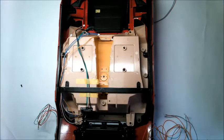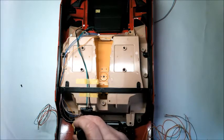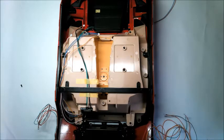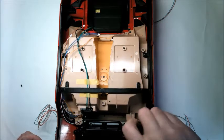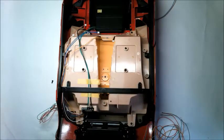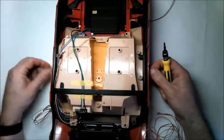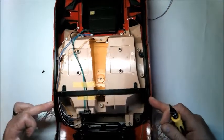Turn the assembly over, and then you need to secure 2 6mm screws into this hole here and this hole here. You can then fit another 6mm screw into each of the side tab holes here.